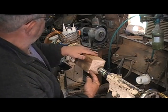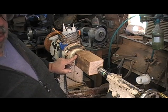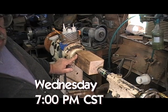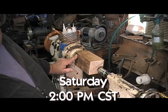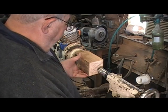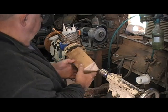That's going to cause this piece to swing in an arc — and that arc is what we're going to cut off. We're going to take this corner off. I did this a couple of days ago for a Ustream video. Ustream TV is Wednesday evenings at 7 p.m. and Saturday afternoons at 2 p.m. — we do live turning, just search for 'Making Shavings.' But you see, when I swing that, I'd have this thing way out of balance, so I'm going to show you a way to cheat into it a little bit.